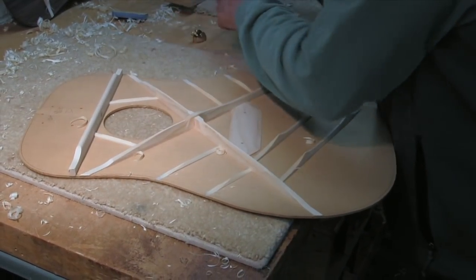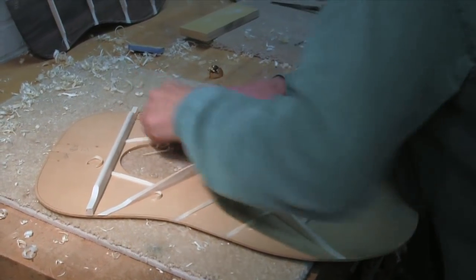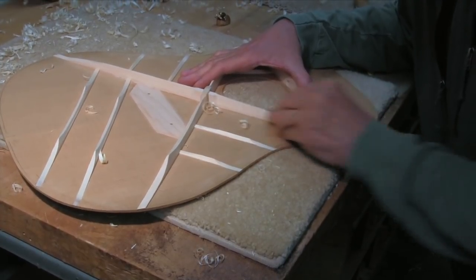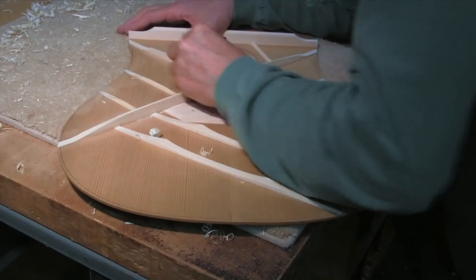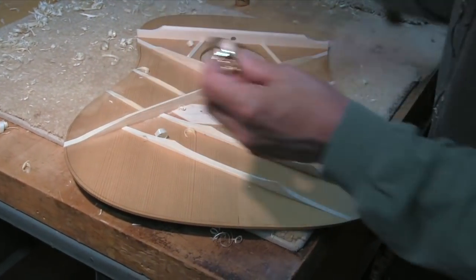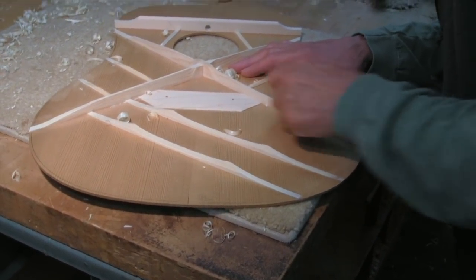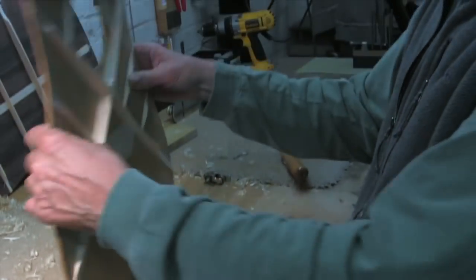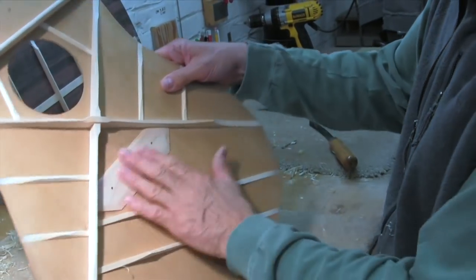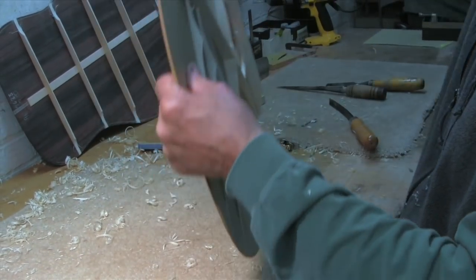This brace is tall and fat on the cross-section. After most of this trimming, I'm sort of in a zone where I can start to work. My usual approach is to tap and flex. Still too stiff here — I may end up removing some material here that will improve the stiffness across this width, but I'll start tapping.